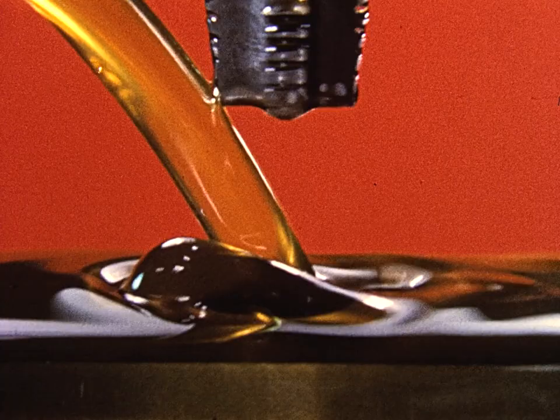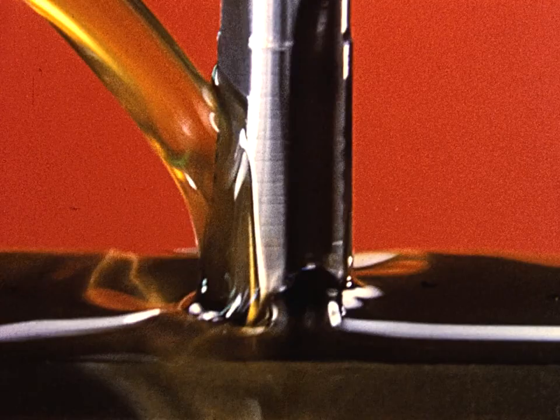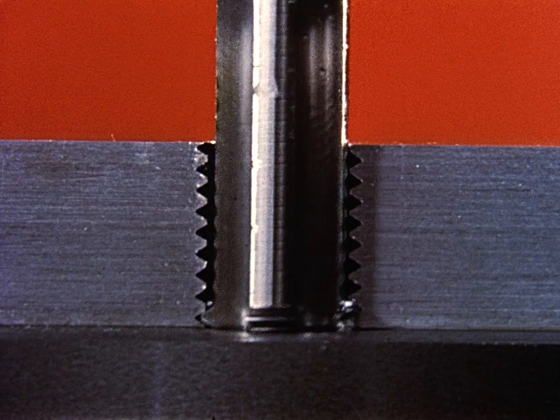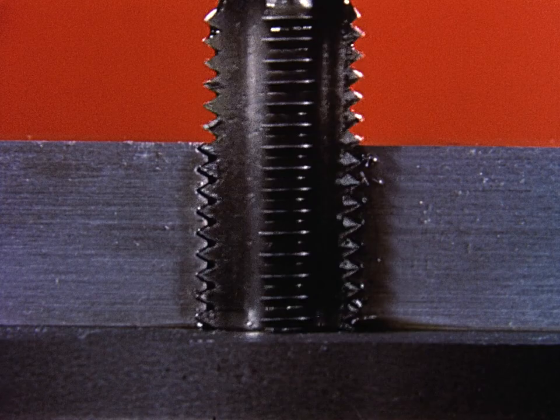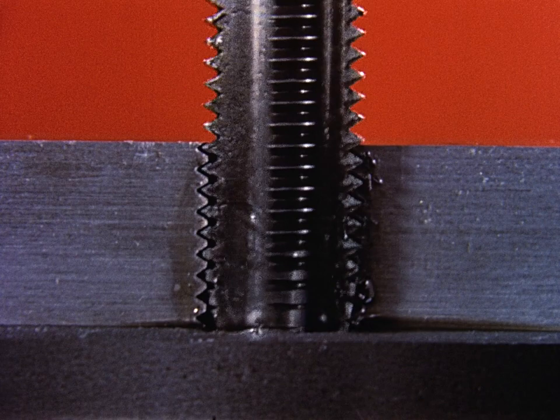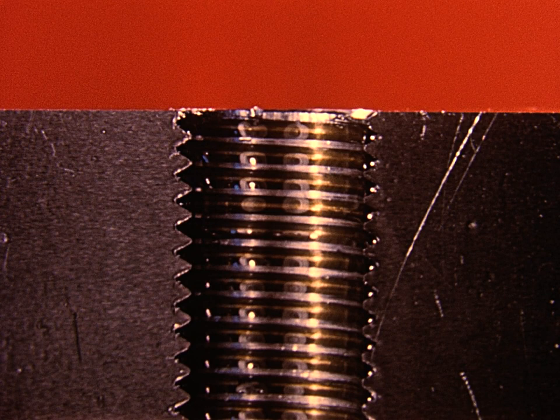This tap will do essentially the same job as a complete tap if the head, spindle, chuck, tap, and drilled hole are held in perfect alignment. Here in cross section of the hole just tapped, we see that the thread is accurate in every detail. Teeth back of the chamfer are used to guide and support the tap as it goes deeper into the work. And when the tap is withdrawn by reversing its direction of rotation, these teeth assure a smooth withdrawal. More important yet, they permit the tap to be sharpened time after time and provide the flutes for chip removal.